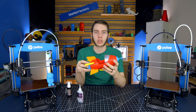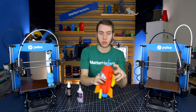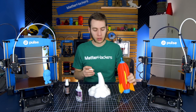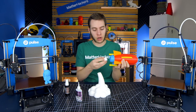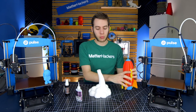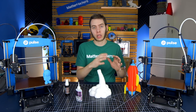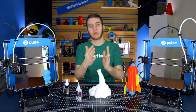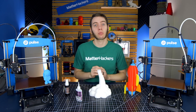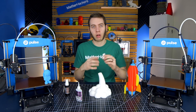So there is Phil's rocket ship, but there's one more thing we have to glue together — the plume that you use to mount this. The rocket plume was printed in Pro Series PLA, and it has this little piece that slides in and stays glued so that Phil's rocket is displayed on it. I printed the base plume at 30% infill just to give it more density than the rocket to hopefully offset the center of gravity and prevent it from tipping over — maybe 10% or even 5% would have been fine, but that's something I need to do more testing to determine. Just put a little glue on here, spray, lock it on, and that's it.